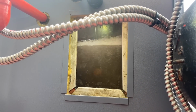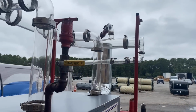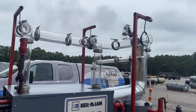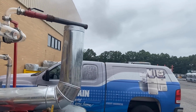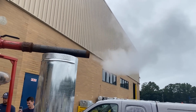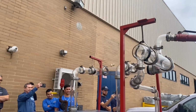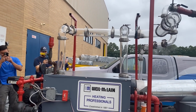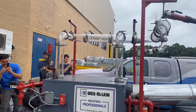That's actually pretty clean. We sometimes put a couple of drops of vegetable oil in there just to simulate a dirty boiler. Maybe the last person that used it did, so it does look like it's got some crap floating around in the boiler. Now we're in full steaming mode. Pretty violent in there, as I said. If you look at the gauge glass, it bounced a little bit, but it's pretty steady. You can see the pipes, it's clear as can be. It's dry steam.